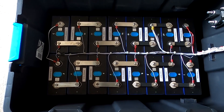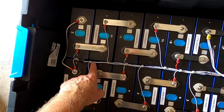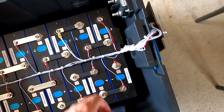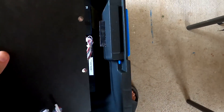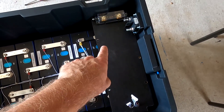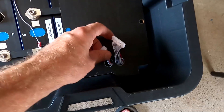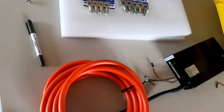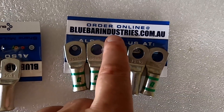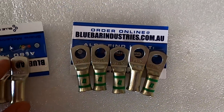Here is the nearly ready-built battery. All the balance leads are now fixed in the middle with cable ties, running in one string to the front. This will be the board where everything sits on — BMS, shunt, fuse, switch — with balance leads coming out here.